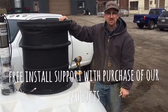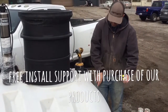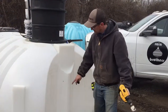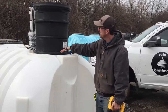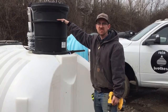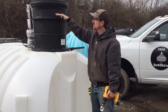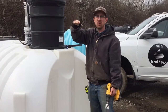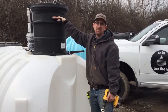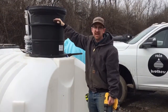For this application we need a two-foot riser, so we're going to account for this two-foot riser and then add another 18 inches and make a mark on the tank — that's where we're going to drill our hole for the pipe penetration. That mark accounts for not only the height of the riser but also where we're going to backfill to. We always want to leave a few inches of riser above grade — we usually use eight inches — to ensure no groundwater contaminates the tank through the lid. So our backfill level is going to be right here, and three feet down from that point is where I made the mark.